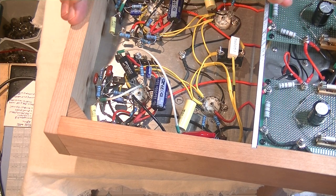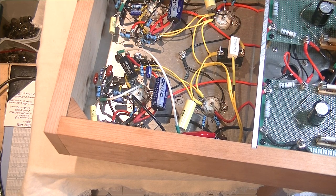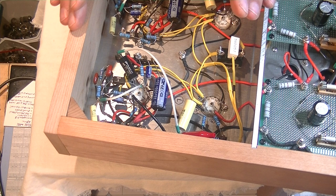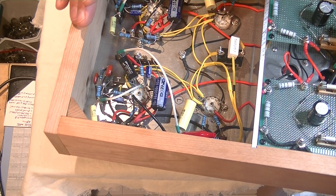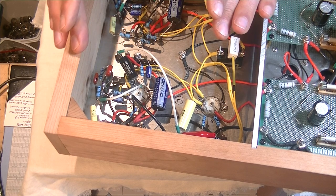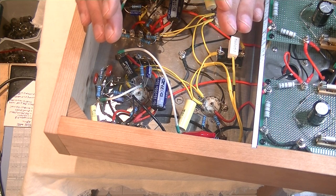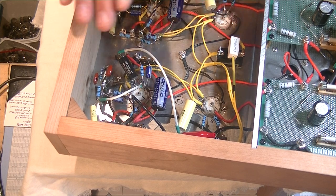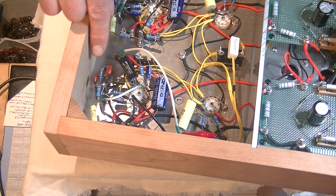There's some ways around it when you're cutting a record, but what the record companies started way back when, RCA, and all of the labels had their own EQ curves, and eventually the one that RCA came up with ruled. It's called the RIAA curve. And essentially what a phono stage has to do is not only amplify that very low signal off of your phono cartridge, but it also has to adjust the EQ so that it's back to flat the way it came off of the master tape. And that's what that little section does.